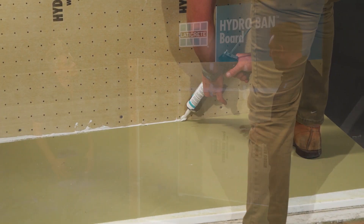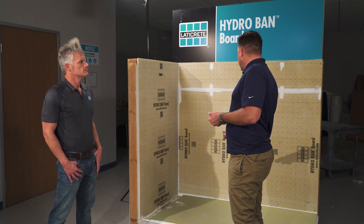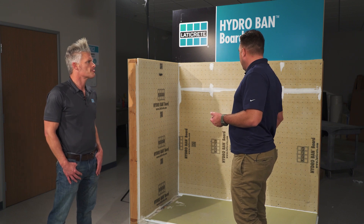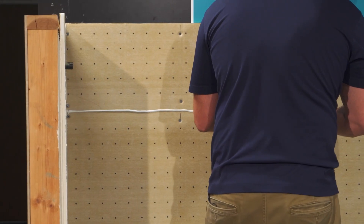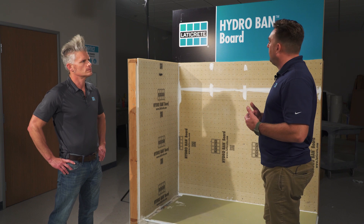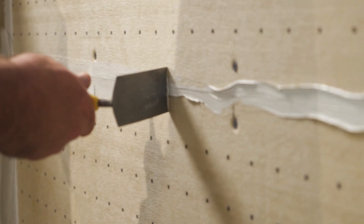If you're using a mud set method for the shower pan, you can apply the caulking directly using the gap that TCNA specifies for hanging wall board. In this case, we have a pre-fitted gap for the pan itself, so you fill that in with the hydroban adhesive sealant. Apply it to the return wall the board is going to be stuck to, then place the board into the seam making sure the hydroban adhesive sealant oozes out and has a good bond.